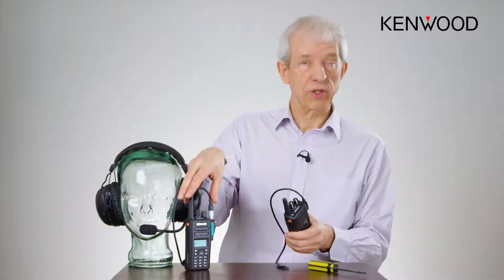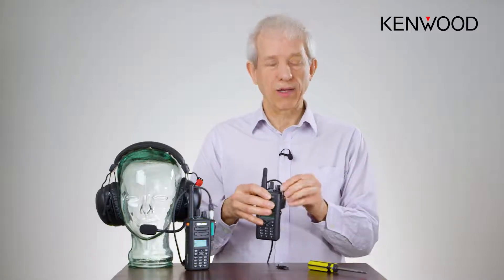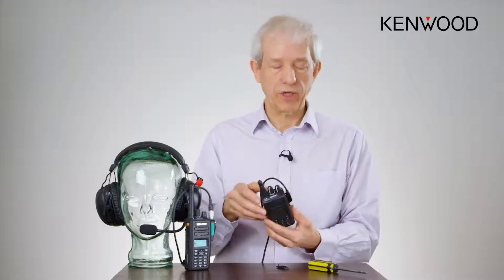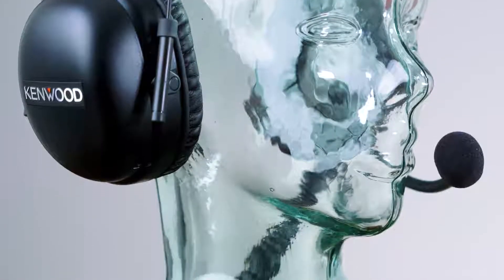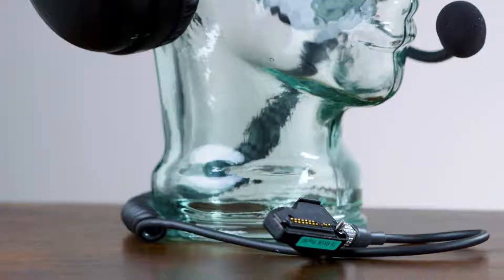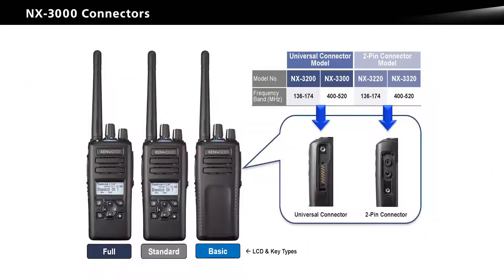The radio can still be charged and everything else in the normal way, and this will stay on permanently — much the same way it does with the systems connector. Obviously the accessories are much more readily available and at lower cost for 3.5 and 2.5 millimeter connectors. When you are selecting radios you can go for the 2.5 millimeter or the systems-level connector, and the main concern is whether the user will be adding and removing connectors while in a wet condition.